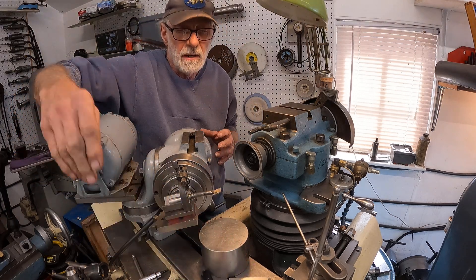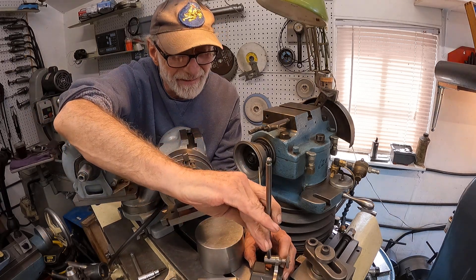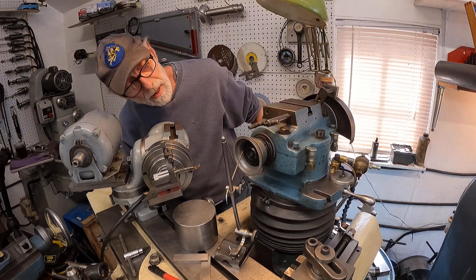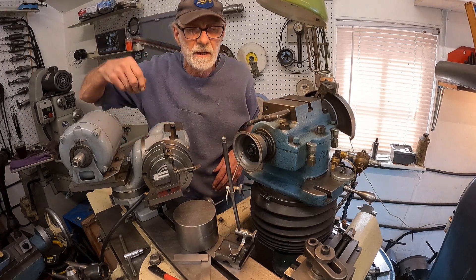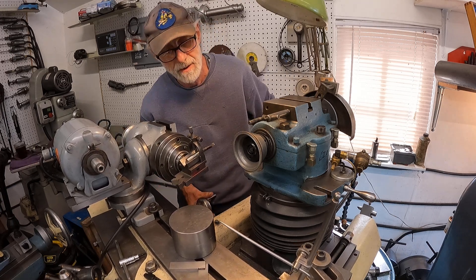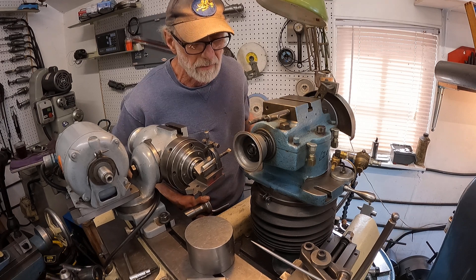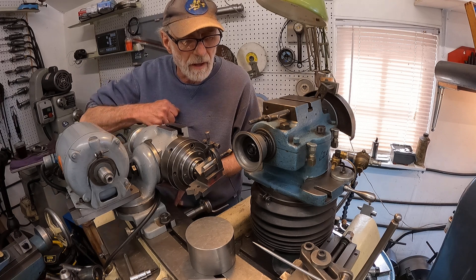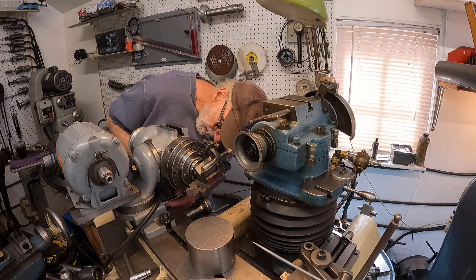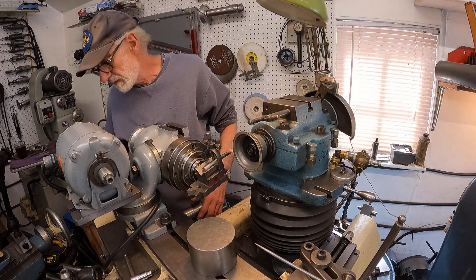I'm generally not feeding in very much. What I like to do is see where it's going to be — give me a little height gauge. I'll roll this back and get over here to dress the wheel head. That looks pretty good. I'm going to rotate it like this. This old-time cutter grinder has the controls only in the back. That looks pretty good right there — I can do a lot of this by eye. I always like to check things in case I forget, because if something's off, the machine will remind you.